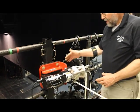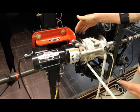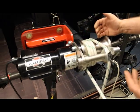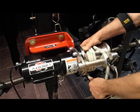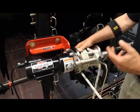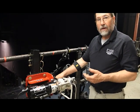On the use of the winch, the basic premise is the friction of the rope and the wraps on the drum. For this winch, and really any Capstan winch, about four wraps is probably where you're looking at. If you use more wraps than that, it increases the risk of the rope walking — meaning it can run and cross over the top of your wraps, which can basically tie a knot and really get you in a mess. So it's a balancing act to have enough wraps for proper friction, but not so many that you cause problems.